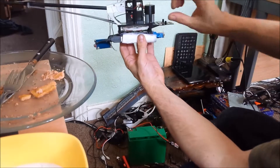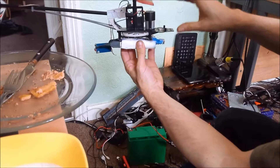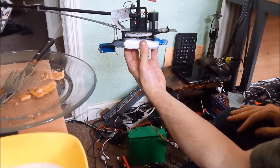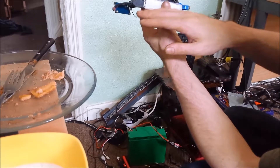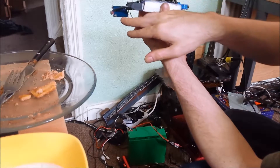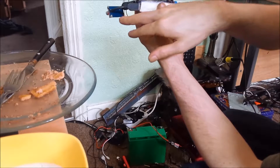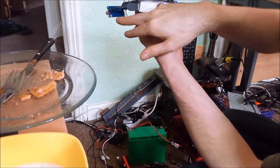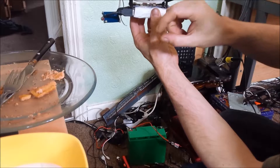So when it's in that last stage of trying to take off, it'll have the power to get off the ground. The first test was to see if it had enough power from the battery banks or if it was too heavy. Now that I know it's the step-up board and it needs a higher amp version, I can factor that in for future needs.